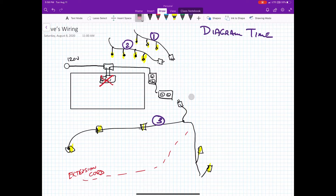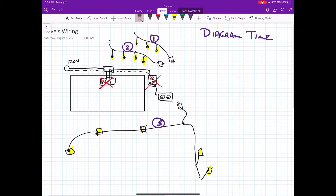We're going to get rid of the extension cord workaround and use the existing wiring by fixing it properly. The way we'll fix it is to abandon that broken GFCI in place. The neutral wire runs in here and gets killed at the GFCI, so everything downstream is dead. We're going to abandon that GFCI and wire everything together directly.